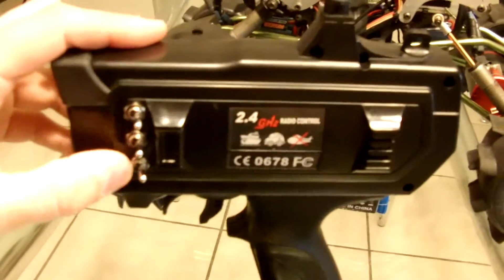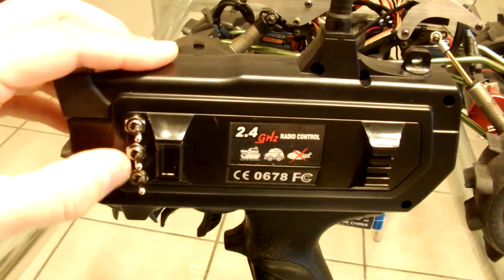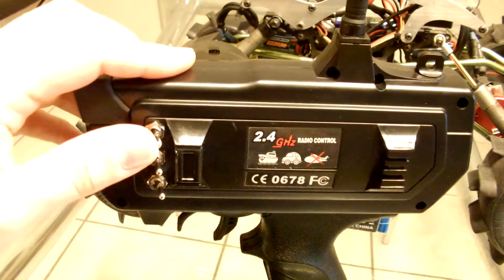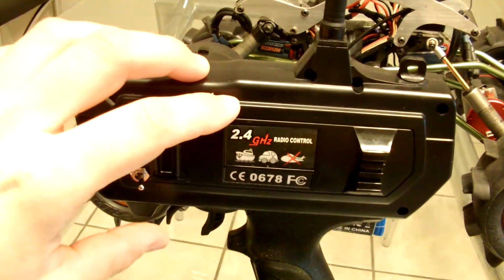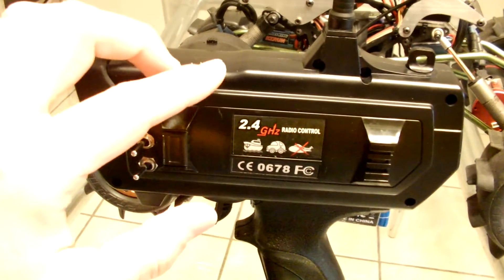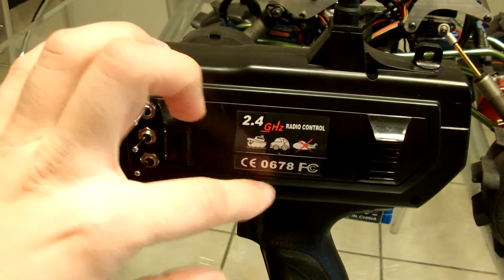So what I've done is I've actually put these switches here. I wish I could have found a single switch that would have done the job, but I only found these at the local Radio Shack so I had to go with three. These are two-position switches — in one position I set the potentiometers to send the normal signal, and in the other position I reverse where the potentiometers connect.